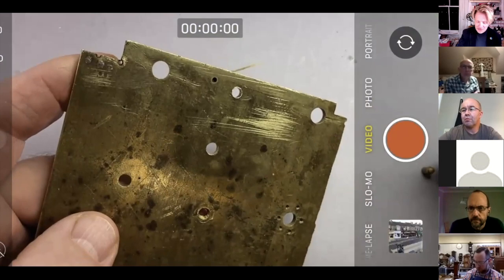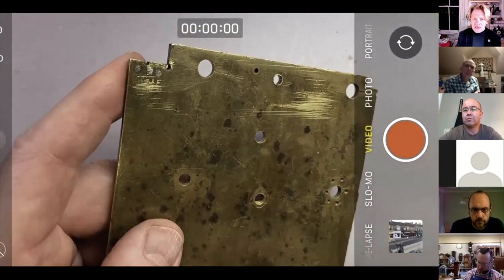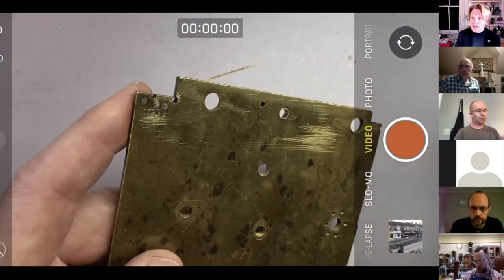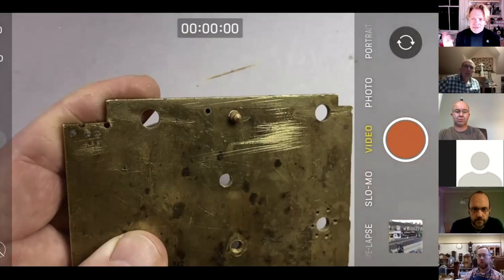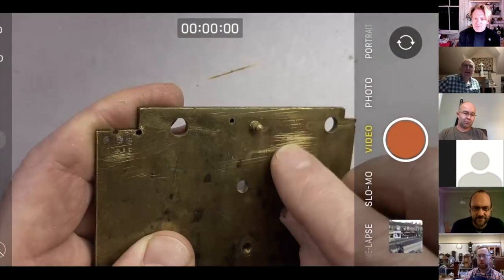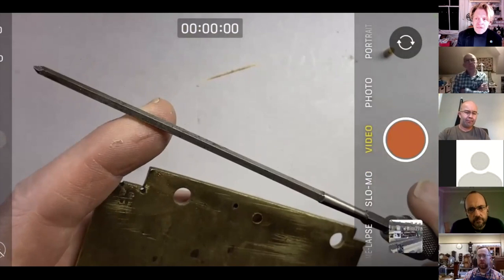Again, moving over to the dark side, so pretend you haven't seen this. This doesn't really apply to bushing because as you saw last week, we just make another one and put it in and it's absolutely fine. But let's say, for instance, you made a new escape wheel and you've made an arbor and a collet and you've put hours and hours of work into that. And you put the two things together and you're working with your graver and it's just a little bit loose. For instance, we can see here, this little brass plug. You do that and you think, oh no, I've got to start again. As I said, here it wouldn't matter, just make another one. But if you've got a lot of investment in those parts, there's a couple of dark tricks. So as I say, you've got to keep this to yourself, don't share it with anybody. You will remember our five-sided cutting broach, which is normally used for making holes bigger, but you can also use it for making holes smaller by pushing the broach into the hole.